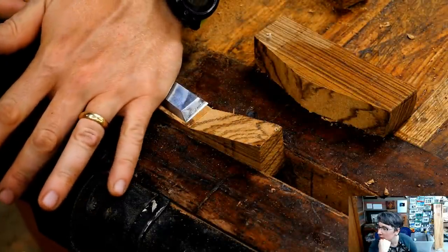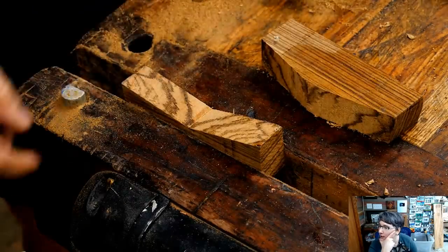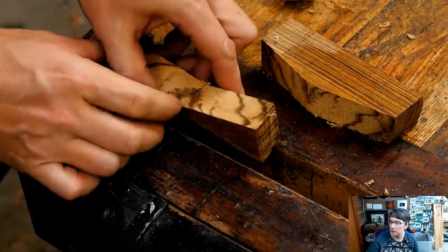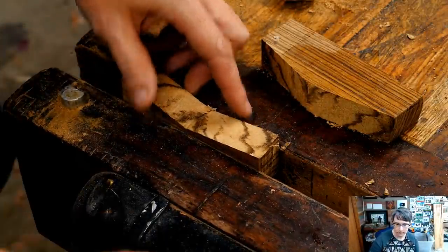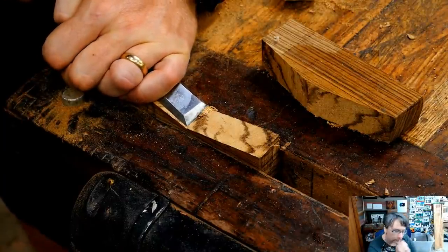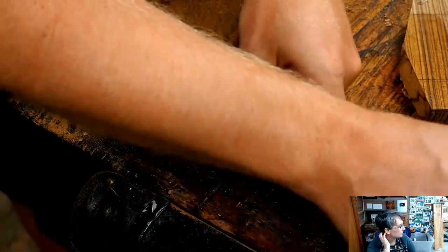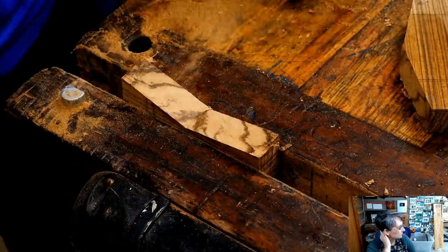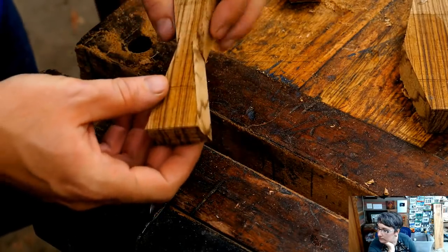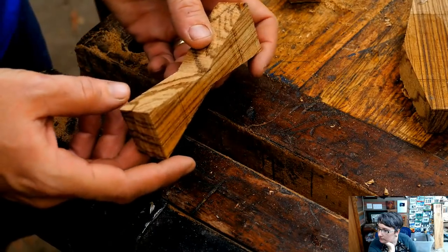So while you're doing that, I have a question. Sure, what you got? Bryan Fulmer asks, so would you say bow ties are more for wood expansion type stress rather than a joint? Yes. They're not a very strong connection. They're not intended to add strength to the joint. They're intended to be there for looks, but then also just stop that slow pressure that comes on it.